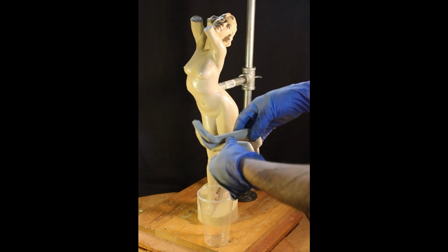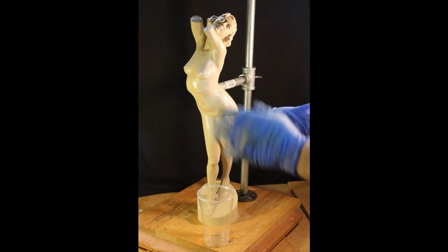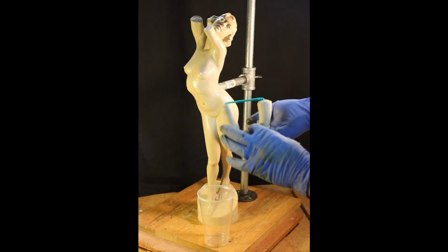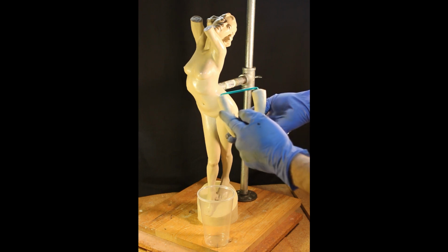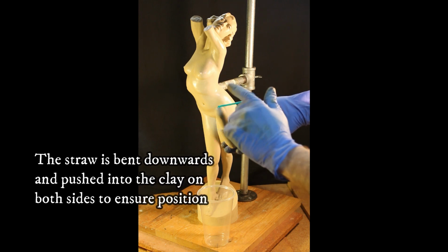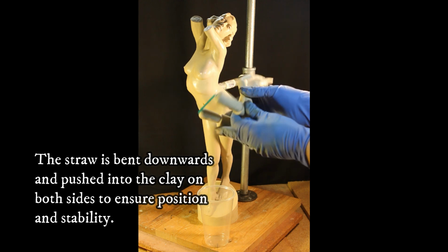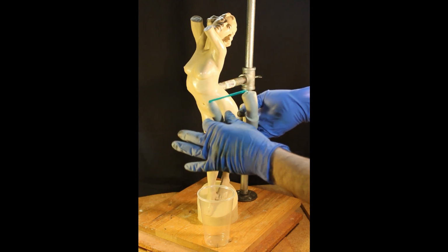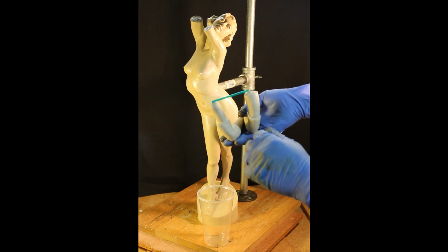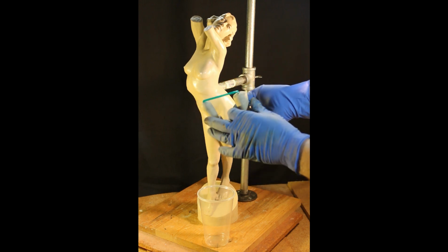And these arms here. What I ended up doing with the arms, I'm not going to do a block mold. I did the dimensions and it's just too much silicone. It's not economic. So I made these sprue funnels and I attached them, and then I put a straw across here just to add support. This really serves no other purpose. So I will cover this with silicone up to here, and I can always trim that back to where I need it. But don't go chintzy and only bring it up here. Bring it up.